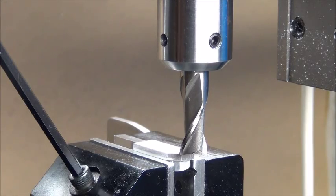Just a few more little things to do. The first thing I did was knock off the sharp edges off of the parts. I took some 800 grit wet/dry sandpaper and just sanded around all the parts and knocked the sharp edges off. I didn't do any heavy duty rounding or anything, just basically smoothed them out.